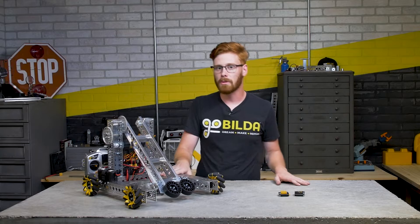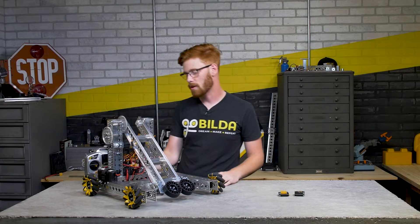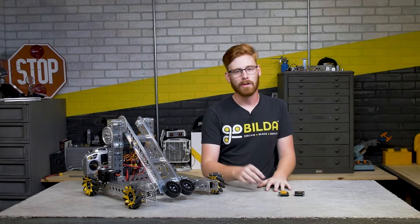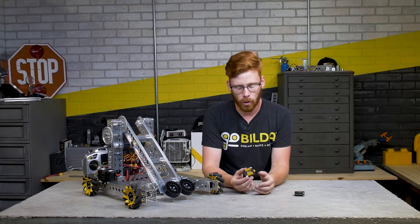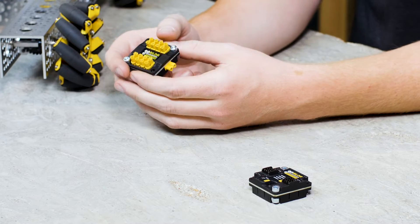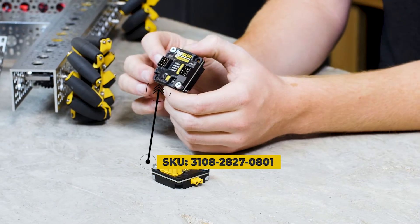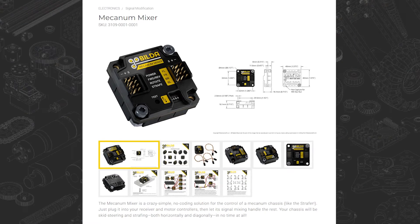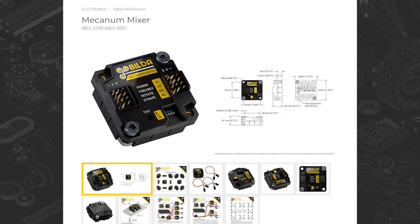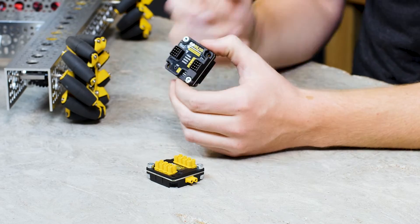Here's the robot we're working with today - it's a fairly simple robot with a mecanum strafe chassis, a single motor arm, and two servos for a claw. It requires exactly six inputs to control, which is how many we have on our transmitter and receiver setup. It uses two additional electronics components: an XT30 power distribution board that takes an XT30 input and provides multiple outputs, which is really handy for the five individual motor controllers on this robot. The other component is a mecanum mixer - with a mecanum wheel chassis you ideally want three inputs: forward/backward, steering, and strafing left and right, but four motor outputs to create omnidirectional movement.